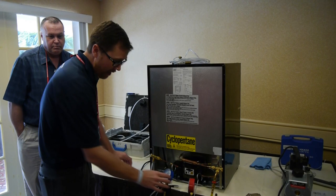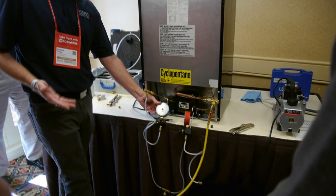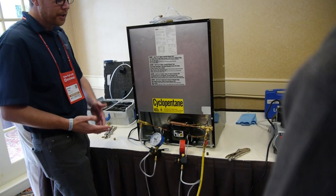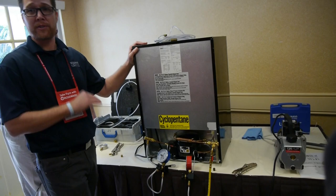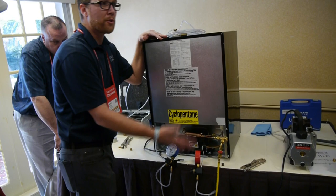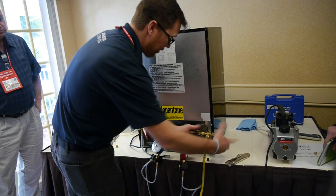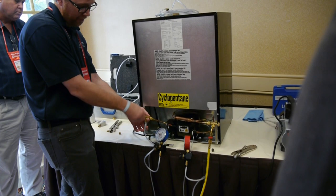I'm down to an ultimate vacuum and I'm not hearing any more discharge. I hooked the gauge up so you could see I'm not misleading you — it really does pull down. I feel confident the discharge process is good to go. The reason I flip this hose like this is so anything trapped in the hose is cleared. When I disconnect, I simply back off to close off access to the Schrader port so nothing can discharge out that side. I'll go ahead and secure the suction side and shut the compressor off.